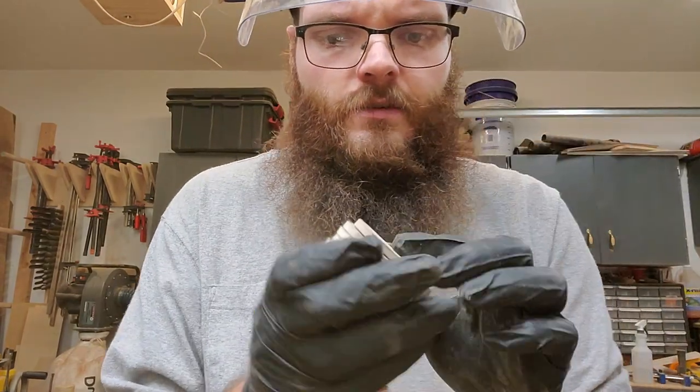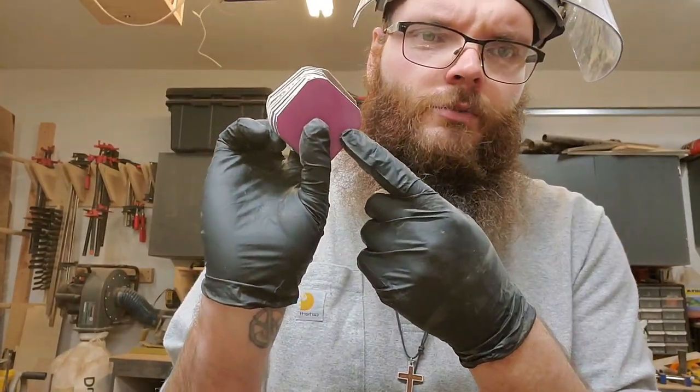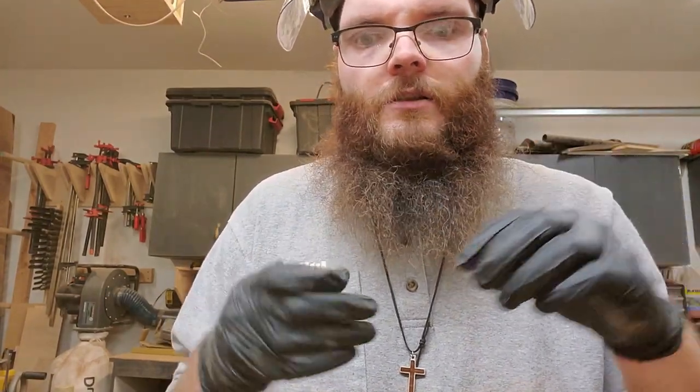These are microabrasives. I don't know if you'll be able to tell, but they're little sanding pads. They start at, I think this one is 1500 grit, and it goes through 9 different steps all the way up to 12,000 grit. It's just glass smooth when you get done with it. But the way that we do this is we apply thin CA glue, hit it with the activator, wait for it to dry, sand with 1, and then repeat that cycle however many, 9-10 times, however many of these there are. So you're building up layers of CA glue, but in between putting more CA glue on, you're sanding all of those tiny little scratches down until there's nothing left and it's completely smooth.